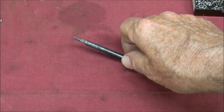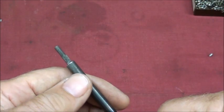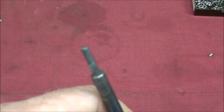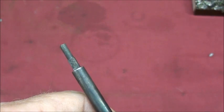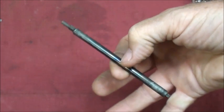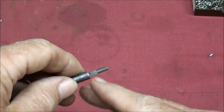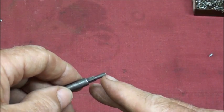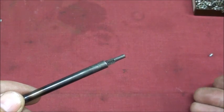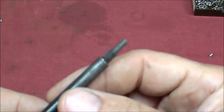The best handle of all is when you make a project and you leave it on the stock, and the very last operation you perform is cutting it off. This is a project I made on one of my other videos for a South Bend lathe. Always make the cutoff as your very last operation, because then you have a built-in handle - a handle to hold it by when you do your hand work, and a way to chuck it in the lathe or the milling machine. This part is square, I milled that square, and then I turned this round, and then heat treated it. Beginners often make the mistake of cutting a piece off to the final length, and then it defies being held by any means.